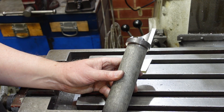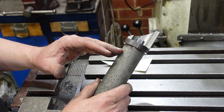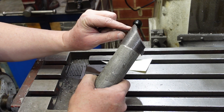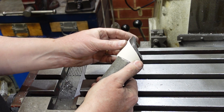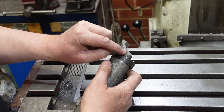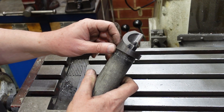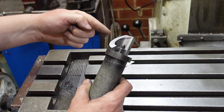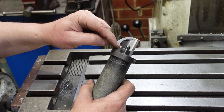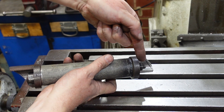I trimmed the ends by putting the two pieces in a bit of pipe with a piece from my strap clamp kit, clamped them up, and cut them — a straight cut at about 42 degrees. There's a black line from the template: it's a straight triangle, and when you wrap it it turns into a sine curve. You can see I've got lots of clearance here and I'm right down on the line. The saving grace is that the cuts are going to be coming out radially, so while that bit's low, this bit here is high. The next thing I need to do is pop this up into the mill on the dividing head and trim it back down using a cutter staying vertical.